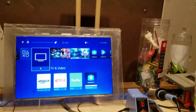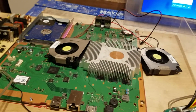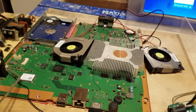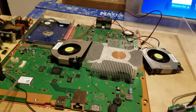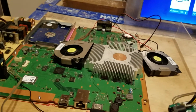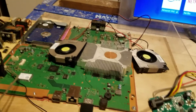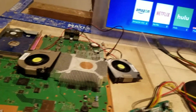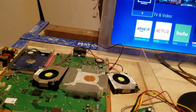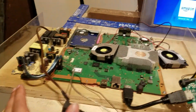It's running just fine. I have an Xbox 360 heatsink with 0.5 amp fans and they're both running off of 12 volts in series, which means they're actually running at 6 volts. They're rated for 5 volts, so with the voltage drop it's okay.